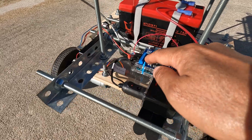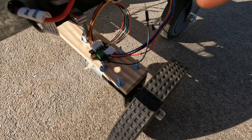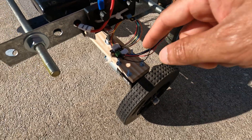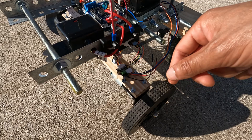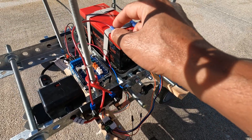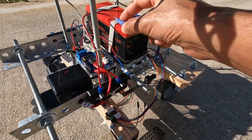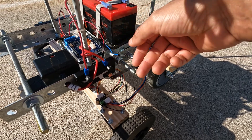You need a very small flathead screwdriver to connect the wires to the terminals, and for the motor adapter you need a very fine tip Phillips head — less than a millimeter. These terminals do not take thick gauge wire. I was trying to use 22 gauge solid wire but the connectors were not secure, so I needed to fold it — double it up — to make it more snug. I ended up using jumper socket wires instead.